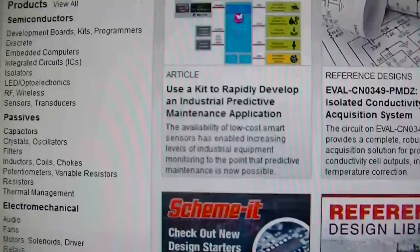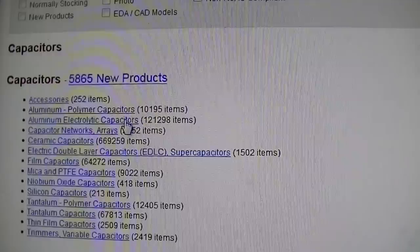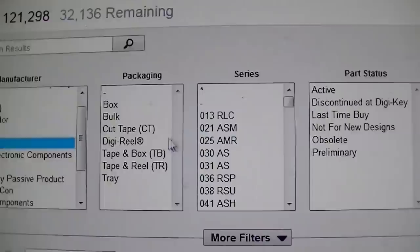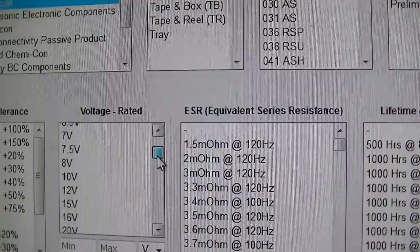DigiKey.com, you go to capacitors. This is aluminum polymer capacitors, aluminum electrolytic capacitors. And then what you do is you start applying filters. So we are going to do Nichicon, and then we'll do 2.2 microfarads, and let's see, more filters, and yeah, this is going to take some time, so we'll do rated voltage, we'll do 25 volts,